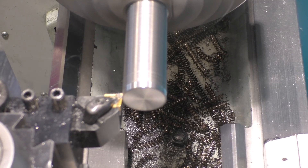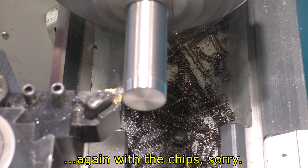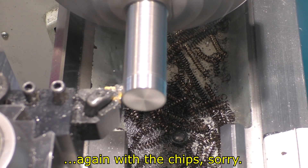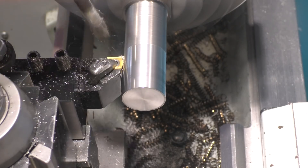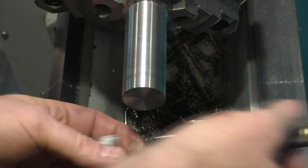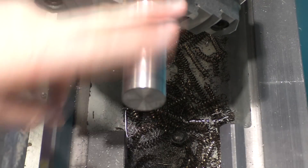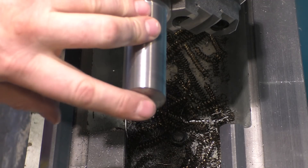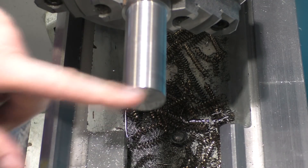Much better already. I think I pushed it a little too much and damaged the edge there. This looks pretty darn good — still about three ten-thousandths. I think I could have done better than that, I've done better before. Anyway, we're just going to relieve this edge just a tiny amount and then we're going to drill and tap.